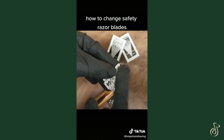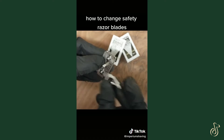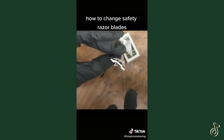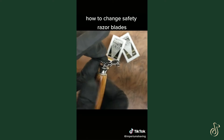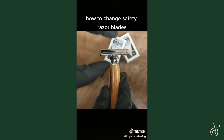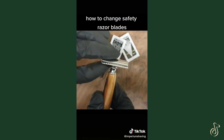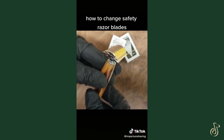There are two other guides on there to watch out for. Take your head assembly, the two pieces, and put them back together. Make sure that the arch is facing up. Screw in clockwise. Be careful not to touch the face of the blade on either side — I'm touching the bottom and the head. You don't want to touch here because it's sharp. Make sure it's tight, but you don't have to get it overly tight.